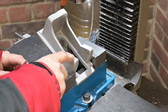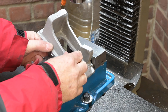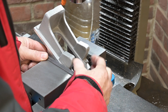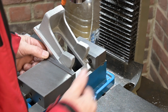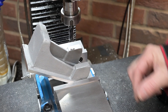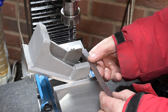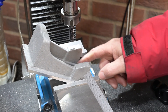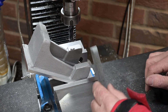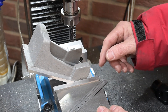The next part of the project is to mill these faces at 30 degrees, which is fairly straightforward — I'll just set it up on a 30 degree angle block. This little piece on the casting has been left in; it's going to be cut off eventually but it's there so it takes up the clamping forces, otherwise it'd be difficult to clamp these. These are showing as half an inch on the drawing, showing an inch and three-quarters between them, so there will be some to machine off these faces. Those faces are probably better machined with this laying flat, so I'm just going to machine these surfaces first and just clean them up without taking too much off.